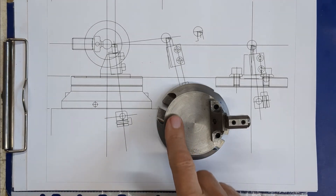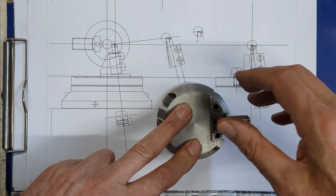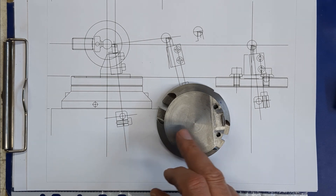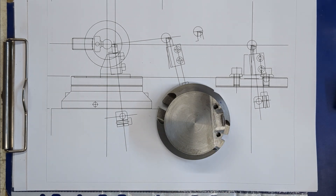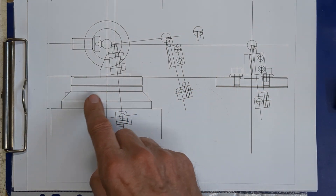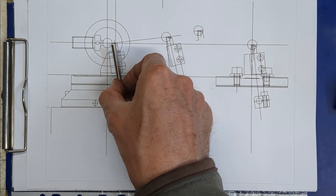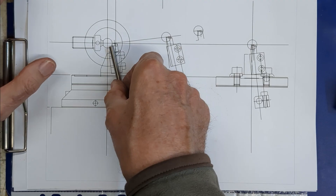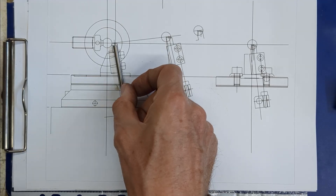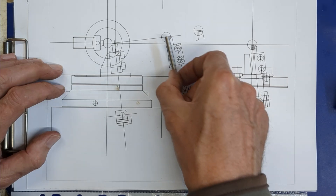Since I have lots of space on the turntable I'm hoping to have an additional tool holder, so this one can be removed and I can place a tool holder somewhere in this area here, and that will look like this so the tool will be mounted vertically. I toyed with both square section and round and after some trial and error I finally came to the conclusion that round was better, as shown here.